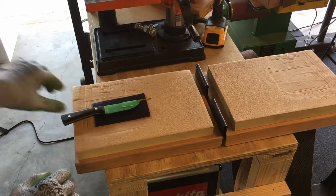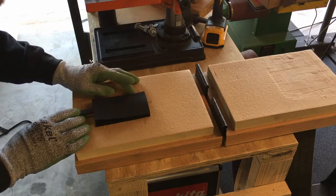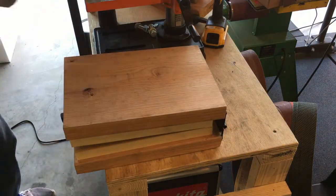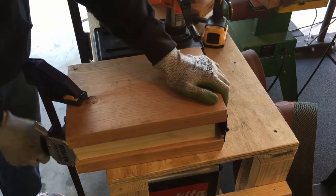Take them out of the oven, lay your first sheet down, put the knife on top of the first sheet, and then as quickly as you can, get the second sheet on top, line it all up, close your kydex press together, and clamp it down. This is a DIY homemade kydex press — just two pieces of 2x12 and some foam I found on Amazon. I'll try to find a link and put that in the description below.